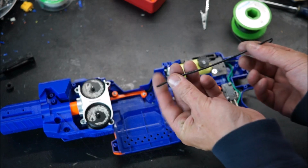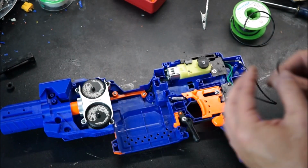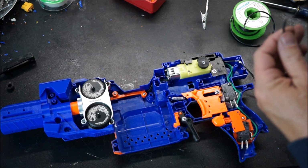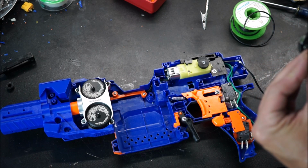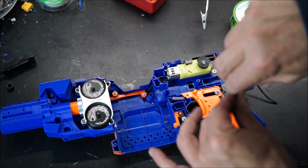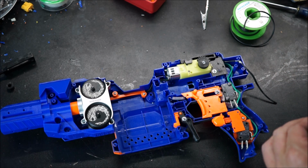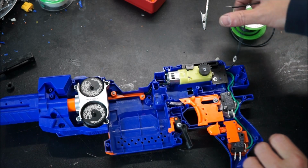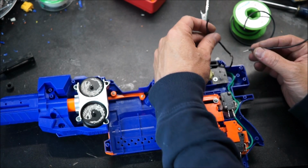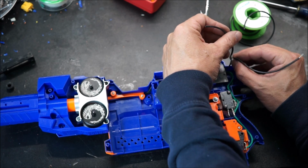Take your wire. Pull, I don't know, 3 or 4 inches off like this. This is plenty. Skin the ends of it. I'm giving you gold here. This is a really, really efficient way to do this. Okay, twist the ends of that up so they're nice and smooth and clean and easy here. The hole that we just made in that, right, and the wire that we just cut, stick this wire in that hole, right, the end that we twisted up.